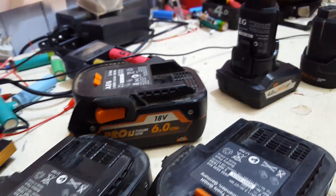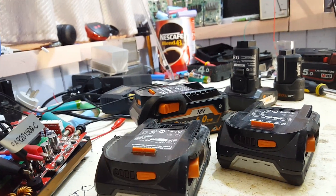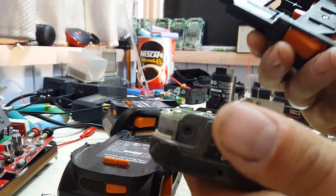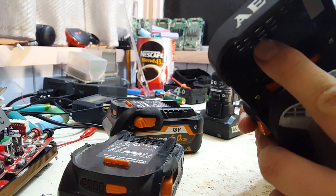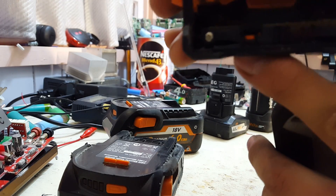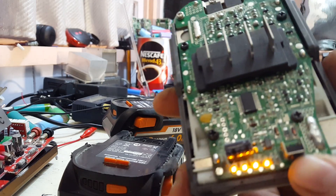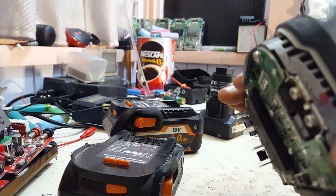Because I'm uncoordinated, doing two things at once isn't my forte. So once you've got it undone, the lid lifts off on this little 1.5 and shows you all the internal structure. You can see the vents — they've got a bit of gauzy, meshy kind of stuff over them to stop big bits getting through. You can see the button mechanism for the volt gauge, and then the PCB on top, including the voltage button, and a couple of nice big ICs and a heatsink.